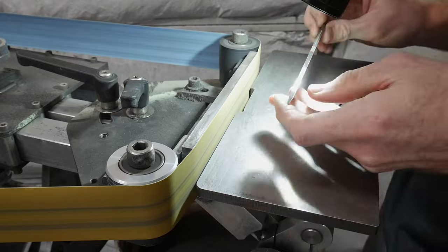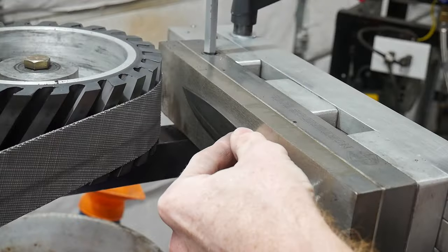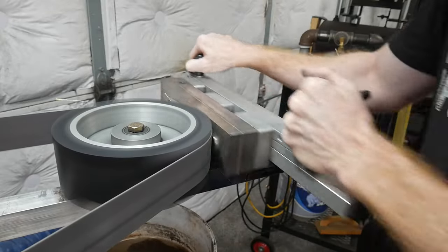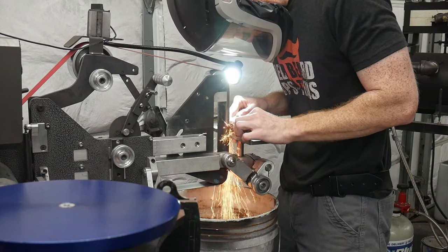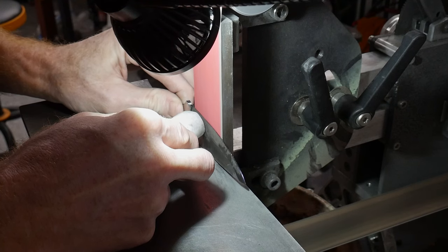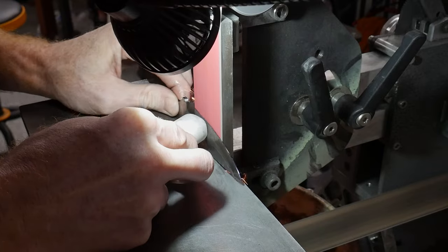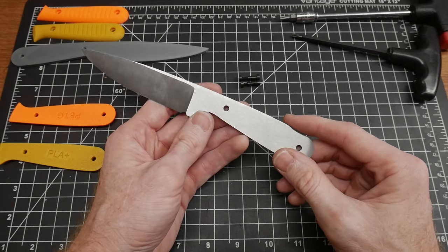With heat treating complete, I generally clean up the profile with my grinder in the horizontal position before hitting the flats on the surface grinding attachment. These two steps give me a nice square blade blank to work with. I started grinding my bevels with a 36 grit belt and then progressed to a 320 grit J-Flex belt.